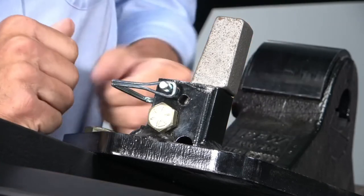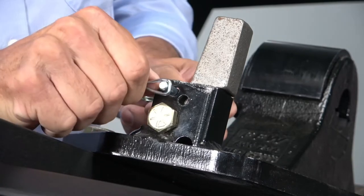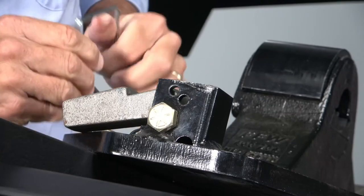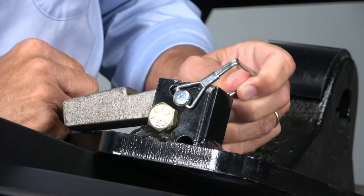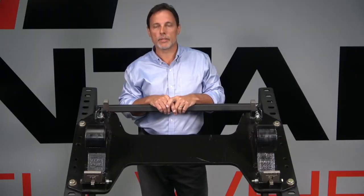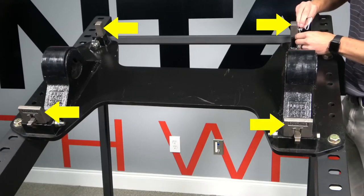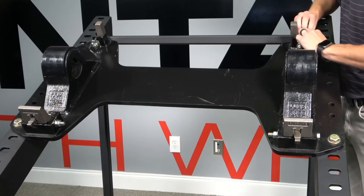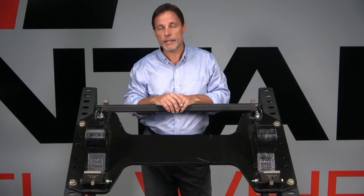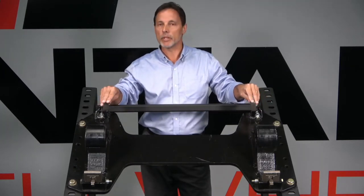When you're ready to get on the road — any uneven or rough terrain you know is coming up — you can remove the pin, put the block back down, and replace the pin for storage. One thing you need to ensure when you're ready to dump a load with a frameless dump trailer is that all four blocks are in the up position — inspect to confirm that. Conversely, when you're ready to go on the road, especially with rough or uneven terrain, ensure that all four blocks are in the down position. Don't inadvertently leave one of them up.